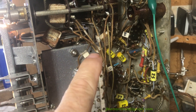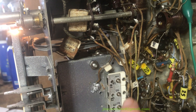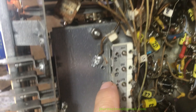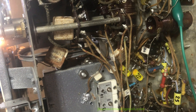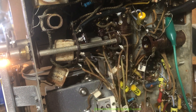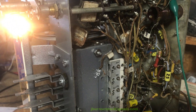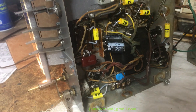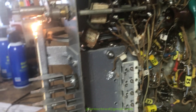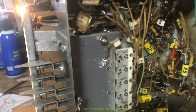If you have any issues with any of the shortwave bands or on the band spread, my suggestion is to watch your lead dress for these particular wires right in here that connect into these trimmers. You will get a definite change in result on that, especially on these, so keep that in mind in case you have any problem with the band spreads or the shortwave bands. Now it's a matter of getting the cabinet ready — I'm going to make some final checks on this.